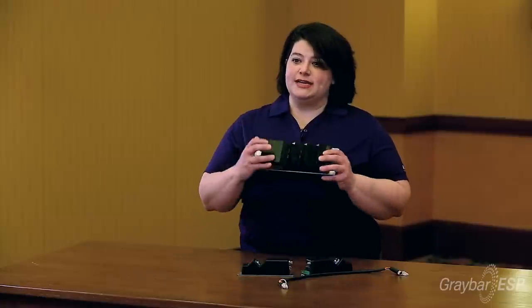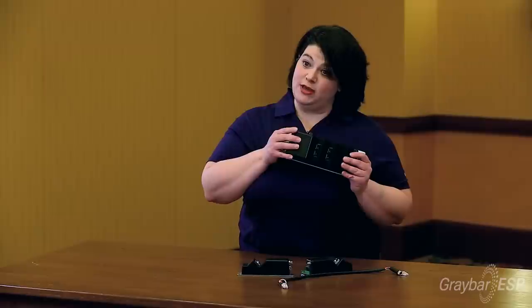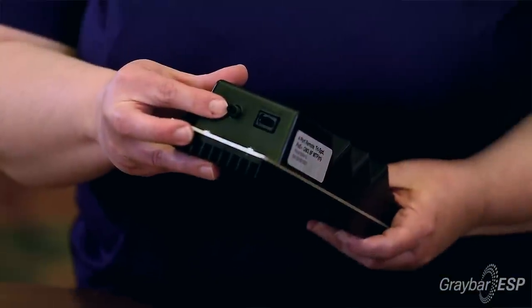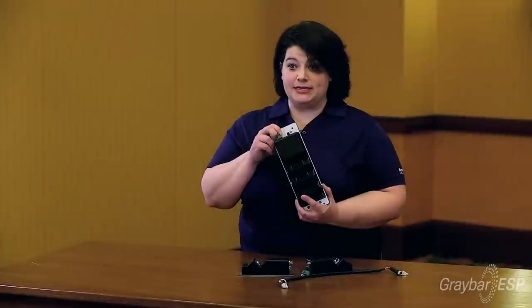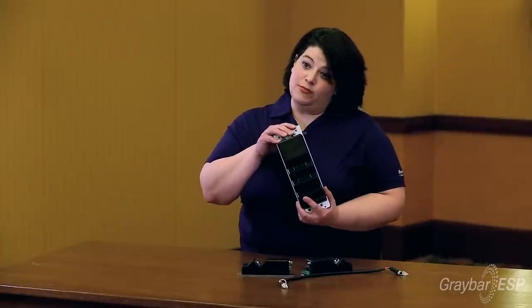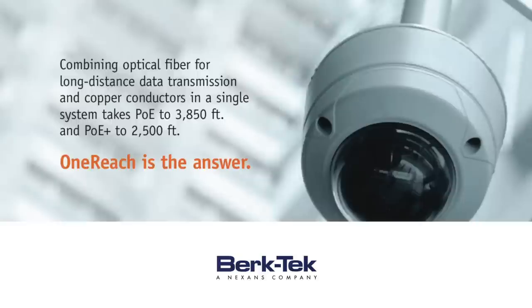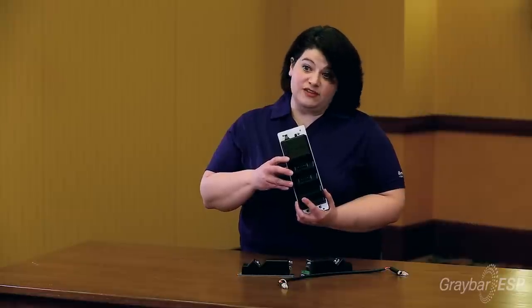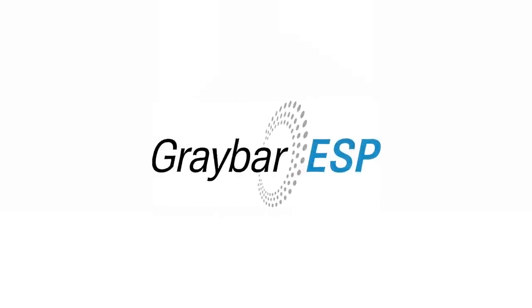If you have a larger project — for example, a parking garage or a multi-story parking lot — we have a multi-port device. You run from the central closet, where you have your backup UPS, out to the parking garage to a central location. One cable connects this device back to the closet. It's a multi-strand fiber that you can then break out to four locations, each up to a hundred meters from this central location. So from one drop, you get efficient coverage of a lot of space, and it makes really good use of your team's time.